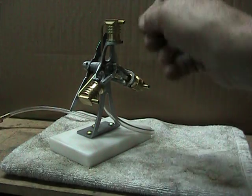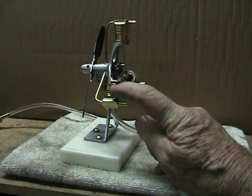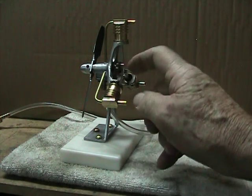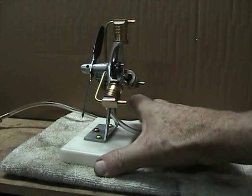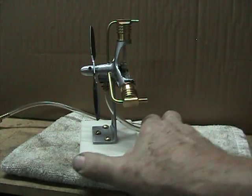These are made from solid brass and then bored out to the right diameter. You can see that the cylinders are attached to the casting by clamping screws. There's a split right here in the cylinder and these are 2x56 clamping screws that tighten down on a shoulder on the bottom of the cylinder.